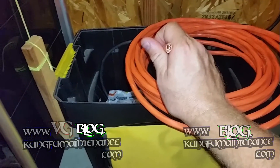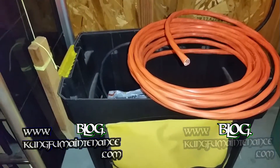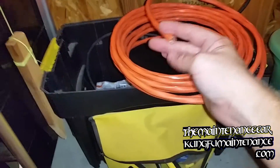The three is for the three conductors. The 10 is the wire size. Wire size, just to be a little bit funny — a smaller wire goes up in number, a larger wire goes down in number. This is a 12 wire. This is a 10 wire. So 12 being a little bit smaller, 10 being a little bit bigger.